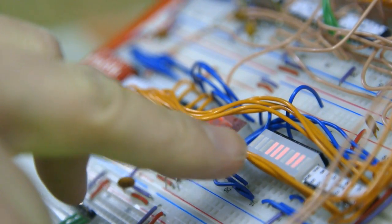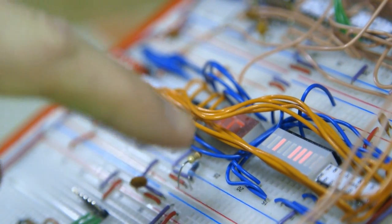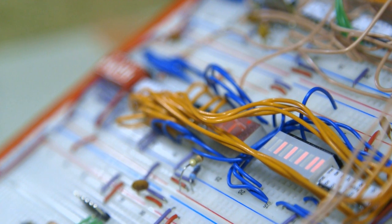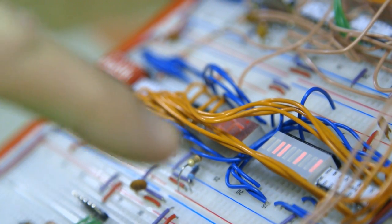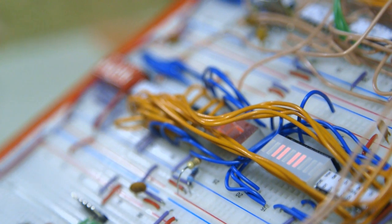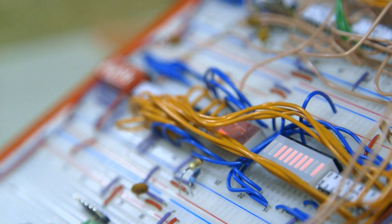In binary base 2, you've got the 1, 2, 4, 8, 16, 32, 64, and 128 lights. Each one that lights up represents that number. It is actually a 10-digit bar graph and we've only got eight digits of data, so ignore the two that aren't coming on — they won't ever come on. Once they're all full, the program will end.